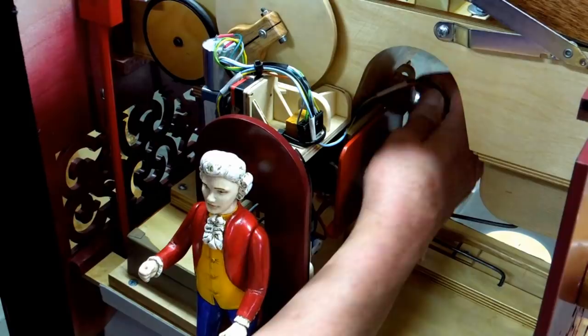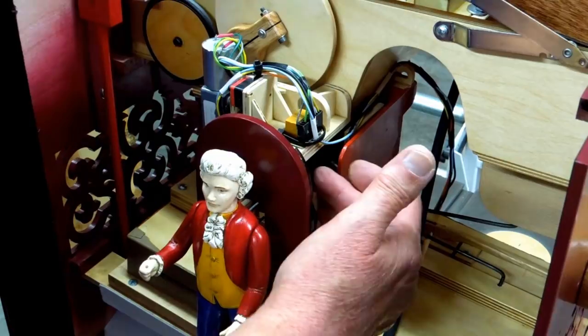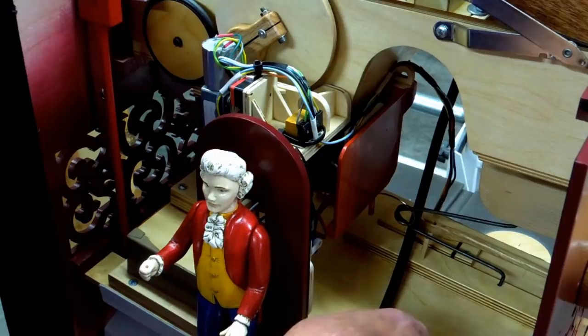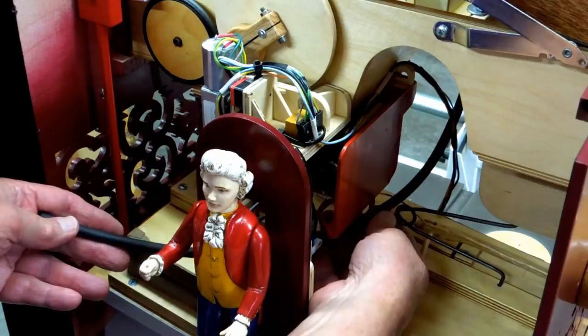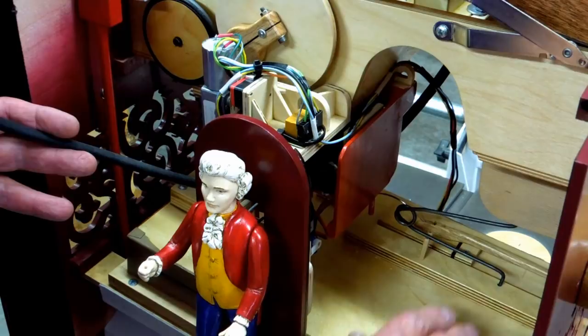You shove this part down in here, and this wire clip — that's part of this red box. This red box was made for the conductor mechanism, power supply, and nano that drive the servos, so they could retract back into it and would not get entangled or interfere with the hoses that are coming out to the front of the organ. You also have to stay out of the way of the spring, and everything has to be above the maximum extension of the reservoir. Like I said, this is getting pretty crowded in here.